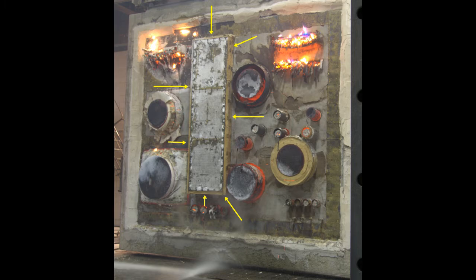Which is, from my understanding, normal sheet metal ductwork, but with a proprietary spray on it. So if there's no insulation of any kind of substantial thickness, then how's the heat prevented from getting in is the question that I would ask. And secondly, if the test standard doesn't call for the thermocoupling, the instrumentation inside the duct, in the engulfment sample, what's going to happen to the fan, or the air, for that matter, that's going to the protected area, right?